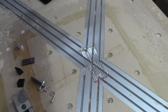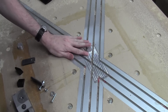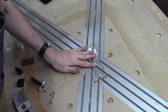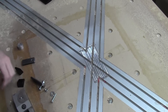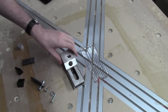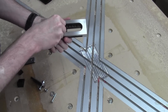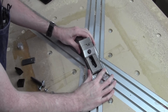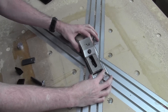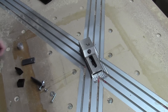On the middle of the little X-wing cross track I have got, I machined this area with the machine — this was done on purpose, I promise. I machined a flat area here and these two edges are a square reference. I have got this screwless vise that I use, and I just stick it on there, double check everything is clean, get it smooshed, and butt it against the end and against this edge. It is just a little registration surface to get it held in.